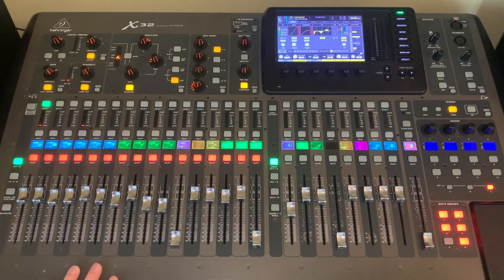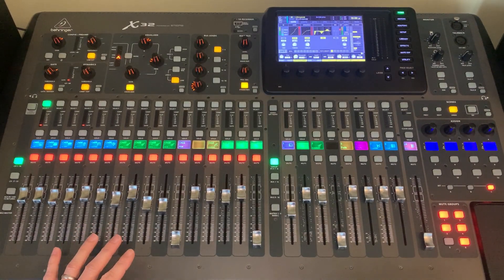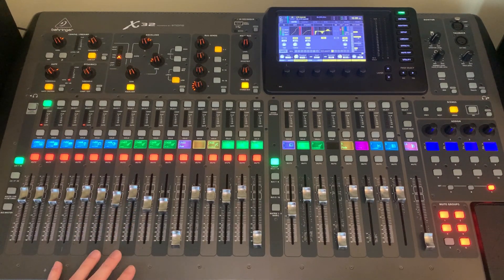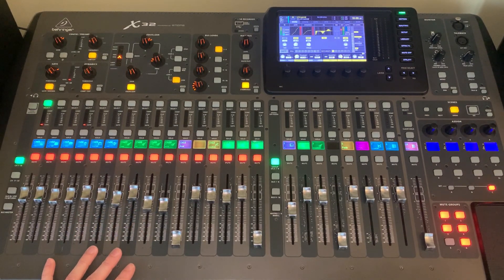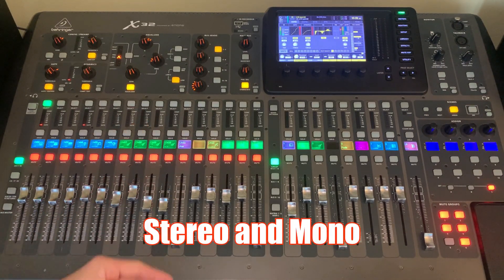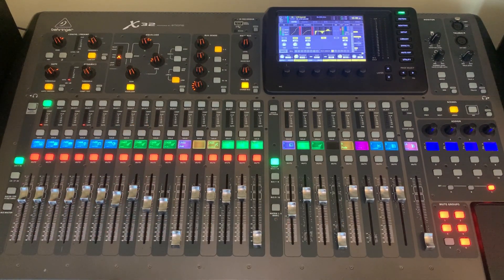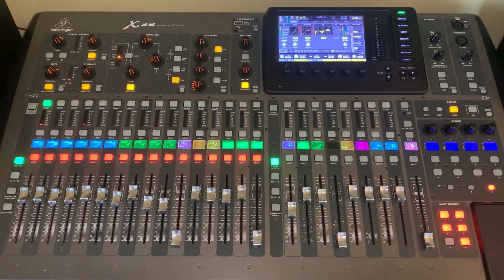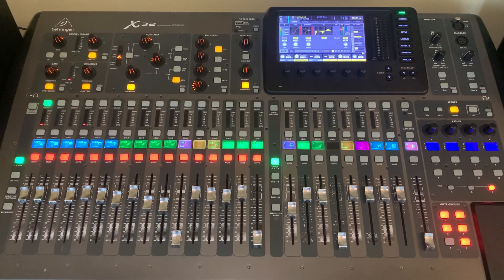We're taking a look at my scene here for my church. One of the things we want to consider when thinking about recording or sending to a CD recorder or the thumb drive is: what is the best type of signal to send? We've got two options — stereo and mono. A mono signal is really easy to set up and build, but a stereo signal is usually more ideal from a bigger picture. A broader perspective tells us that stereo is going to translate better across multiple mediums.